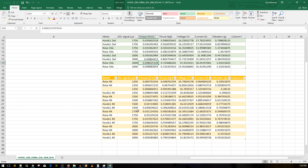Now looking at the King Kong 5045 tri-blades: the Hook LL achieved 828 grams at about 29.6 amps — still very good for a cheap 2205 class motor. In real flight it'll be different, but on the bench that's a strong result. The Racer Star's best result was 731 grams at 23 amps, making it more efficient, which in theory could give more flight time.